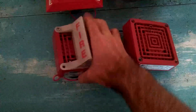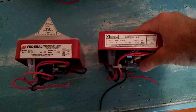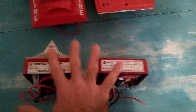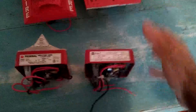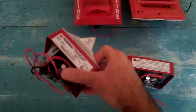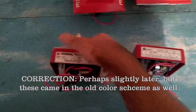So it's just an option that Federal Signal offered for additional protection. This one has the original Federal Signal label, whereas this one is another 2901-9806. Another distinction is that this one only draws 35 milliamps versus the 9806, which draws 63. So Federal Signal offered both of these options at the same time — the low current draw and the high current draw. The high current draw was of course louder, and the only one offered by Simplex. I think the low current draw option was introduced slightly later, as I don't think there were ones as old as the early units with that option.